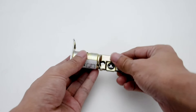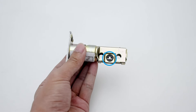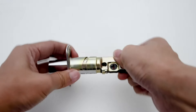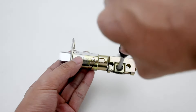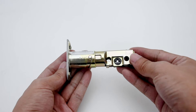If you have Option B, introduce a flathead screwdriver into the T-shaped hole. Turn it left — the bolt will extend and you'll be able to twist it. After you have the length you need, with the help of the screwdriver, turn it right. The bolt will retract and you can install it into the door.